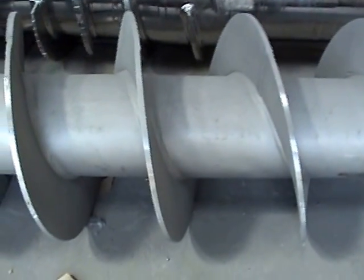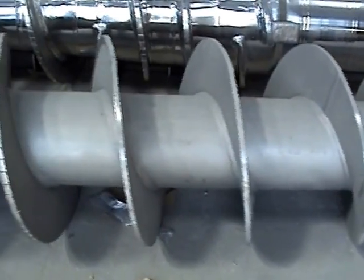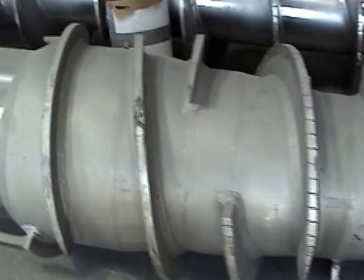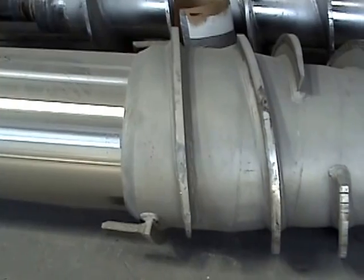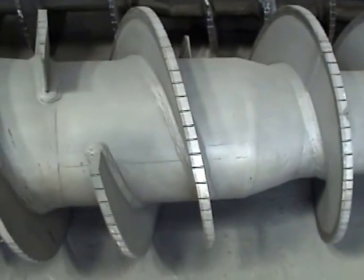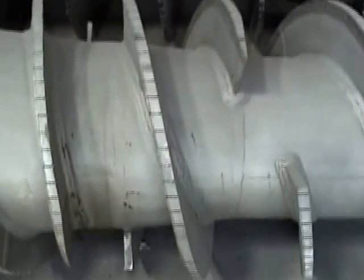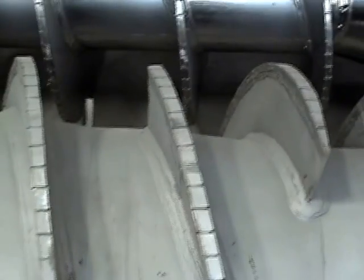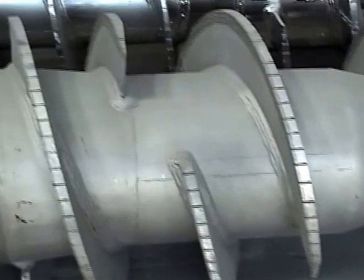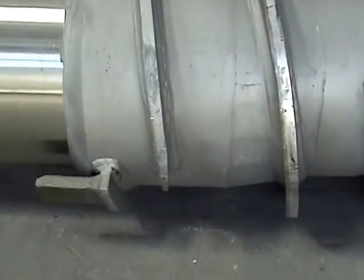The screw has a tapered shaft. Here's an example — you can see a constant diameter shaft. This is where the inlet of the press would be, and then as we get into compression stages, notice the shaft tapering up to a larger diameter. That's the configuration we have in the 6-inch test press. The plating comes along here and stops — there's a gap — and then the plating starts again, stops, and there's another gap. In these gaps we have resistor teeth. So this press has a first stage of compression, second stage, third stage with the third tooth, fourth stage with the fourth tooth, and finally a fifth stage of compression.